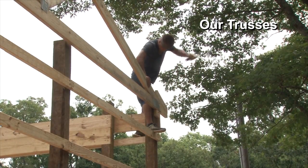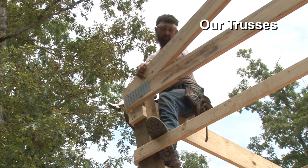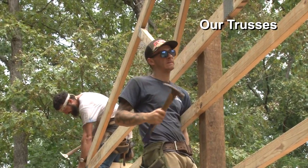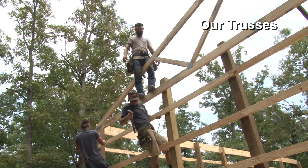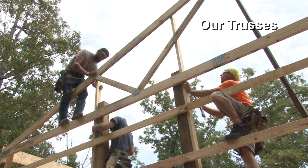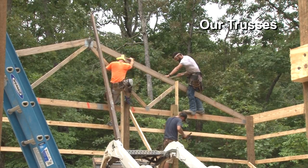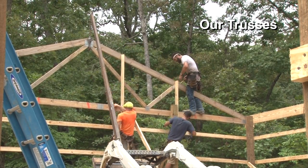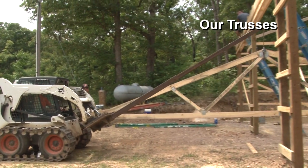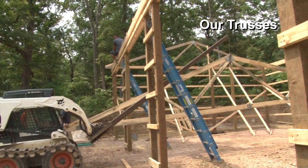Our standard pole barn is typically going to be eight-foot center. A lot of our clients ask about four-foot center trusses — is it necessary, when is it appropriate, am I just wasting my money? It's an excellent question. We can hang ceiling liners, which is the biggest reason people go with four-foot center. We hang 26-gauge, a slightly heavier metal to span eight-foot center, especially in compound spans. It'll hold up, it'll actually make the building stronger, and it'll save on a 30 by 40 building about $400.